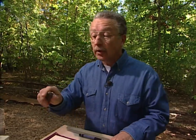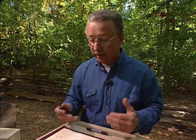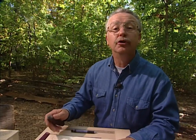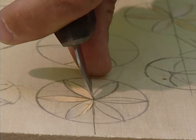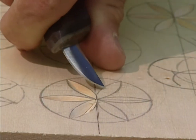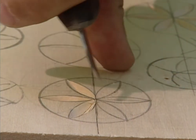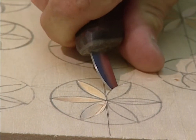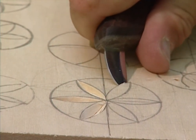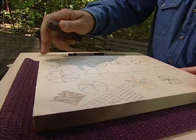Next, you want to hold the knife correctly with your thumb in front of the blade. Now, when I was a kid, my dad said when you're carving, never cut toward yourself. But in chip carving, you do carve directly toward yourself. You lay the knife in there almost vertically, and as you pull it to yourself, you slide the knife sideways so it goes to the bottom of what becomes your chip — like this. In, lay the knife over, a nice even curve, and back out again.